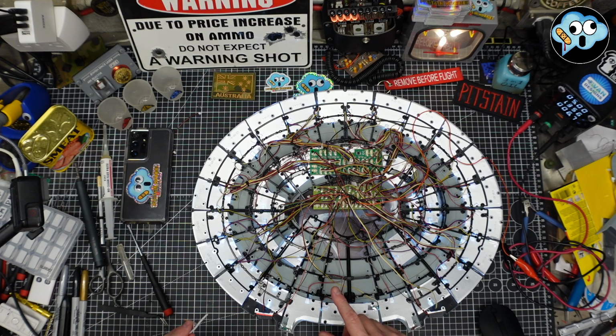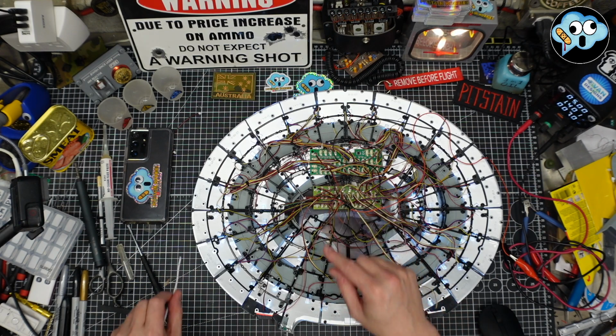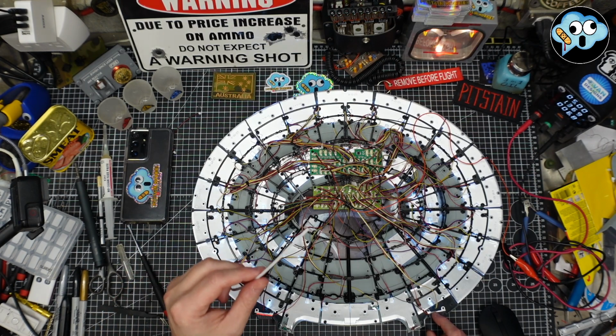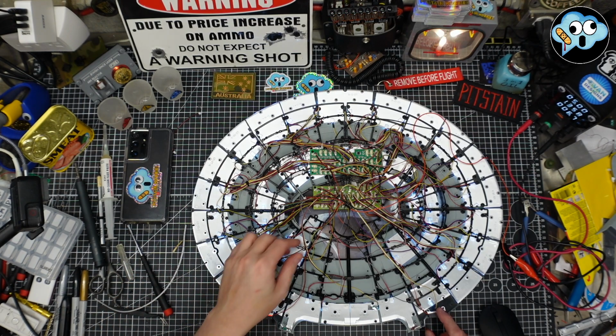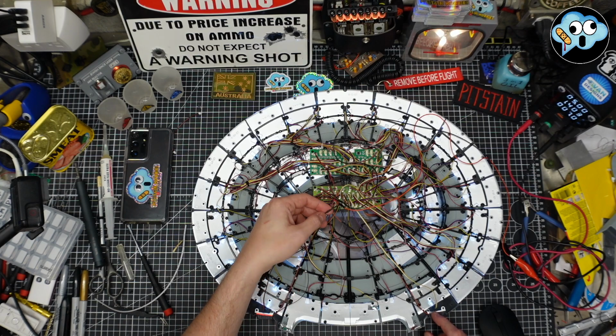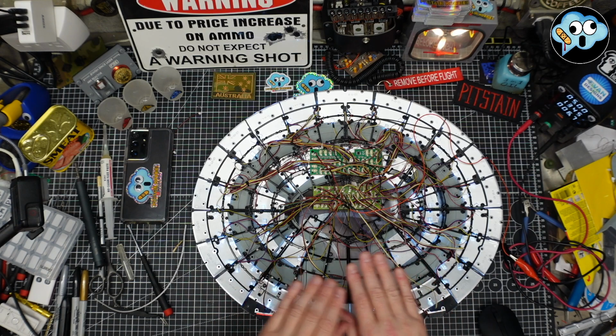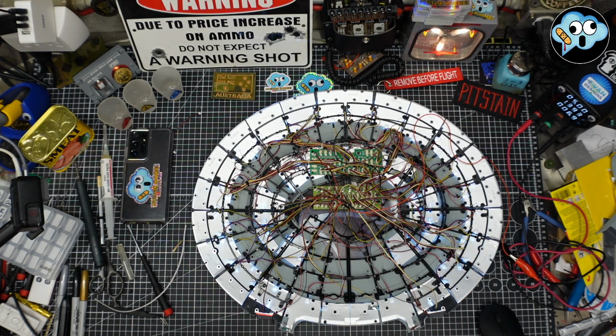However, I did need to resistor these down even more because when I compared it to the stock impulse engines on the next section, these were way, way too bright. So I ended up putting a 1,000 ohm resistor on each one, which dimmed them down just to the point where they pretty much are dead even in brightness with the impulse engine on the back of the neck.